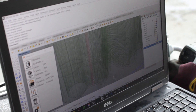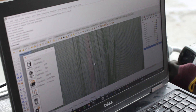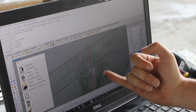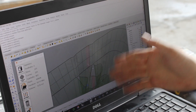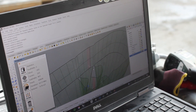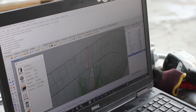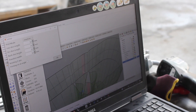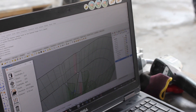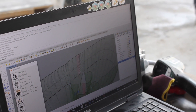The printing time it's stating says it should be over an hour — this is very conservative, and in the end it's probably going to be about 50 minutes or under an hour. I did try to avoid putting as much as possible to the side, so anything that does fall down, falls down in areas where we want to have concrete anyway — just to try and make it as aesthetically pleasing as possible. We did increase the transition width a little bit more than what we normally would: 50 instead of 40, which means that in the top, the transition between one layer and the next layer should be a bit more smooth, a bit less visible.